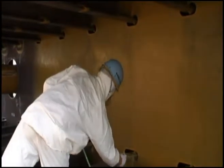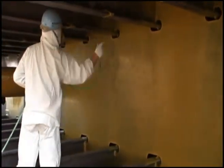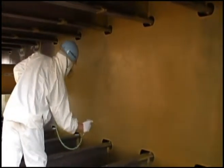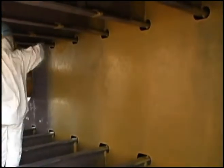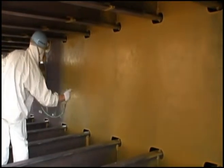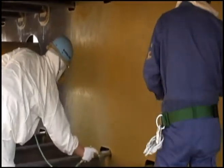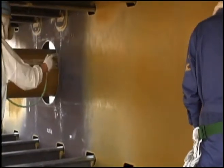Additional spraying on top of the see-through coating. The painter continues, realising the exceptional covering properties of Noah. Additional spraying gives a semi-see-through texture. Wet film is 250 microns thick. Dry film is 200 microns thick.